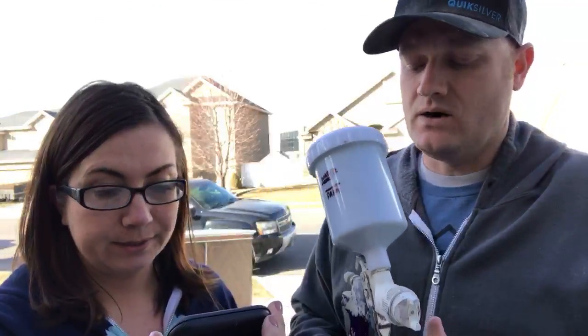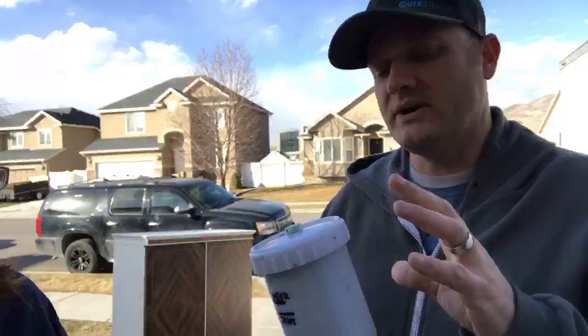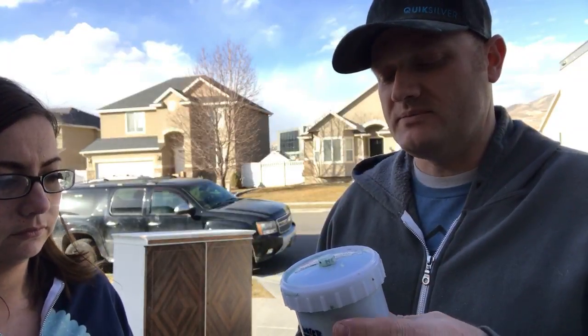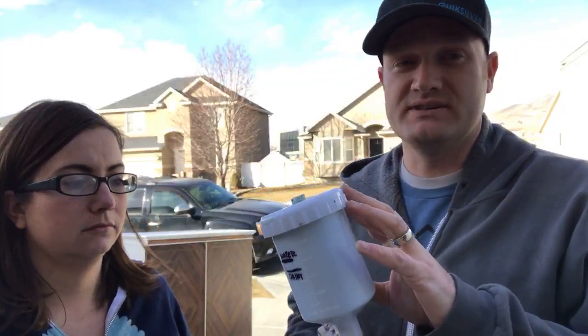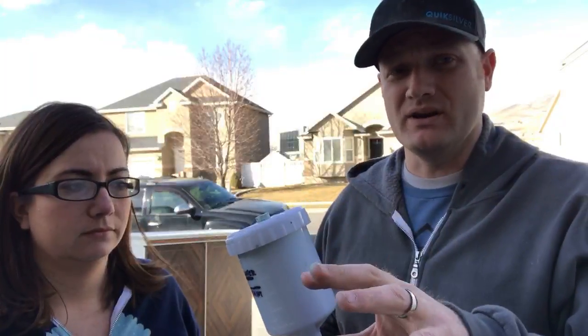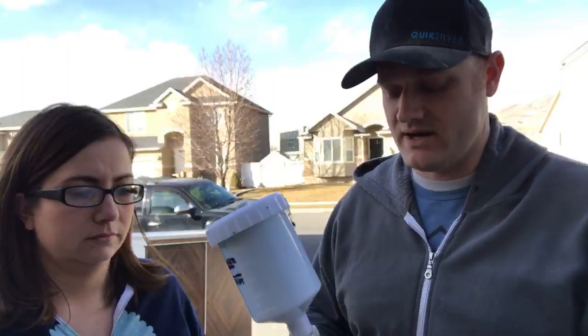Another thing to know on this DIY paint, because it's pretty close to the water ratio I use for the Fairy Chalk Mother paint when I'm spraying, is that I turn the air pressure up. Normally I spray at about 55 to 60 PSI, and this is going to be closer to 70 because that clay almost will splatter on. But don't get nervous, because it levels out and you get really nice, good coverage. So I am going to put my mask on.